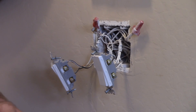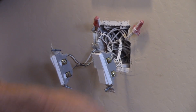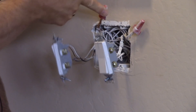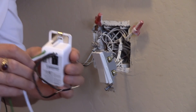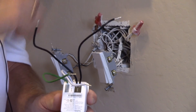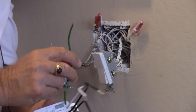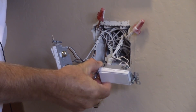One very important consideration with the Wemo Wi-Fi light switch is that it needs a neutral conductor. So I've had to open up the box completely here. I pulled out both devices — the switch for the outside light and the one we already removed for the inside light. I dug out my neutral splice at the back of the box — these white wires here that are actually white, not just because of paint. Also my ground splice, because the Wemo switch comes with pigtails already installed, so you don't want any more splices in the box than necessary. I'm going to clip the wires off the old light switch, restrip them, and terminate to the two black wires on the Wemo — one labeled power, the other labeled load to the light. Then we need to tie into the neutral splice and the ground splice, and eliminate the old pigtail jumper that was coming out of that ground splice to the switch.